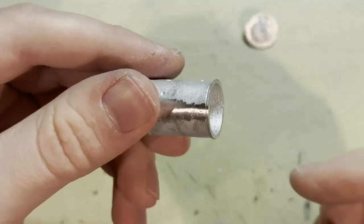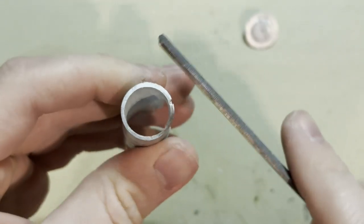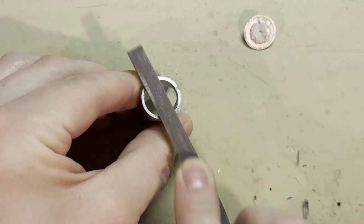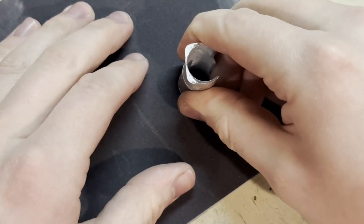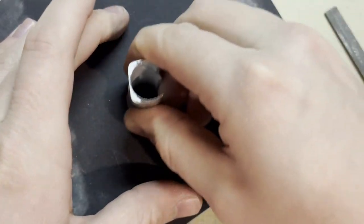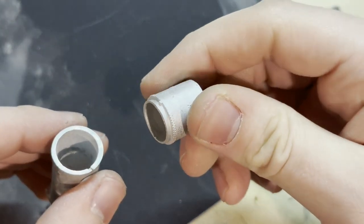I've got it mostly cleaned up now. All that's left is the front — there's one more seam and just a small amount of unevenness. So I'm just going to start by filing that as flat as I can. To really finish that off nice and flat, I'll use this piece of 600-grit sandpaper, so it doesn't take you down too fast.